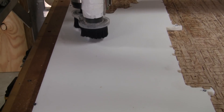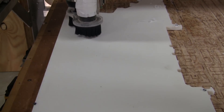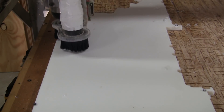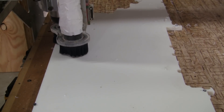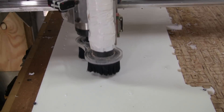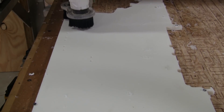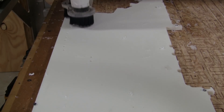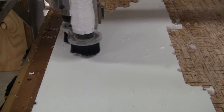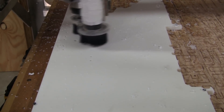You can see the pecking that's going on. Pecking is a machining operation where the end mill goes into the material a little bit and draws back out, then goes in a little more and draws back out. This removes the material so it doesn't get clogged into the end mill as it's plunging. Plunging is really hard on end mills, so it's better to make sure the end mill doesn't overheat. The depth of each pass is also determined by the type of material you're working with.